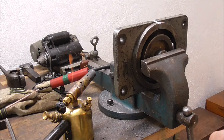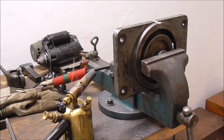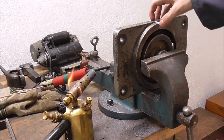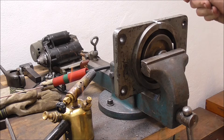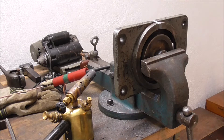All I know is the theory: you should preheat it, then you need a special electrode — this is a chrome nickel electrode. And you should not just go ahead and weld continuously, but you should do short beads. Here is about two centimeters, so we can lay one bead at a time. In between the beads I am going to let it cool off completely, maybe even go at it with a torch again and reheat it so it's not getting shocked that much.